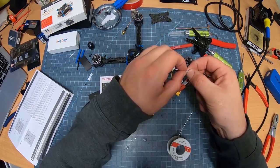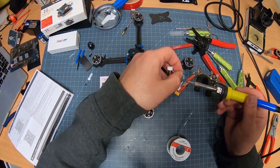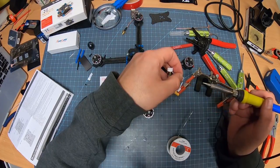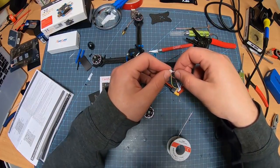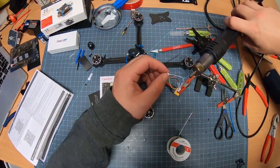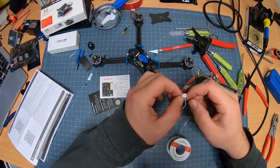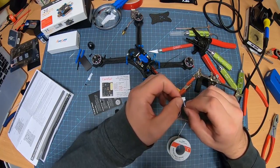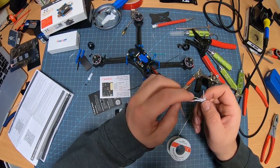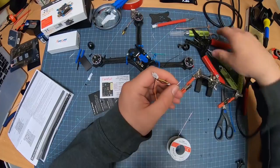Let's get this connected here. The smart audio goes to the TX. A little bit there. Boom. Of course, bring down that heat shrink. Put it on. Shrink it up. Now, I'm not going to use the RX one, so I'm actually going to pull that one out. There's no reason for it in this build. I did notice the last one on here must be video, right? So this should be fairly simple. So I'm going to get that off of here.